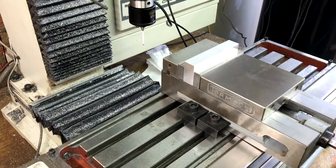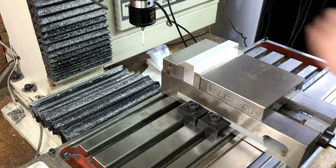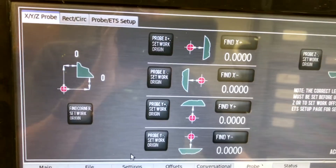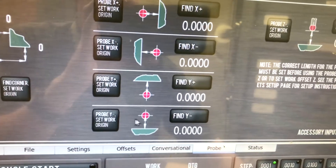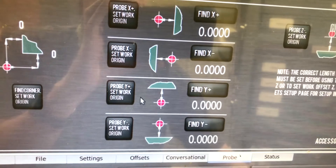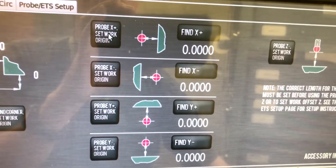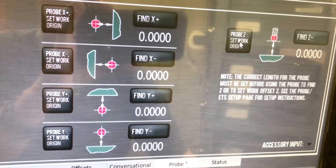I've got that mounted in there and I'll set my zeros. In Fusion 360 I set my zeros on this back corner right here. Change to tool 99, which is the probe. In PathPilot I'm going to use the XYZ probe tab here. I'm going to first select the Y probe while the probe tip is over here, then probe the X while the probe is like this, and then I will set my Z right there.